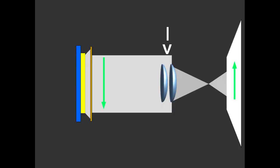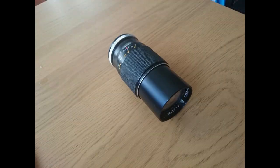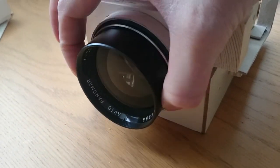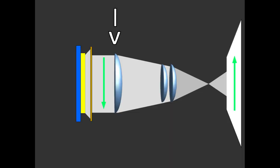The optics. A convex lens is needed as an objective. I had this magnifier lens here which works but gives a bad warped picture. In a thrift store I got this old 200mm objective for 5 euros. It was slightly broken so I didn't feel bad while dismantling it. The front assembly contains two convex lenses and makes for a great-looking projection objective. I also had this large lens salvaged from a broken overhead projector — it is not strong enough as an objective lens itself, but it works well in front of the display so that more light from the display can reach the objective.